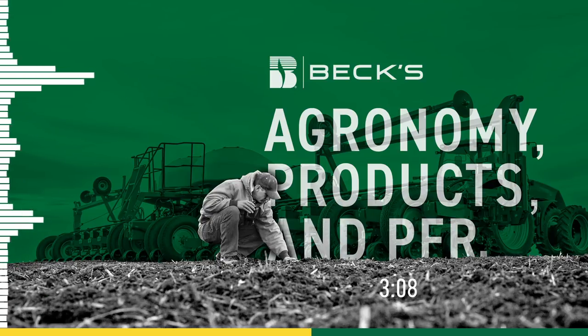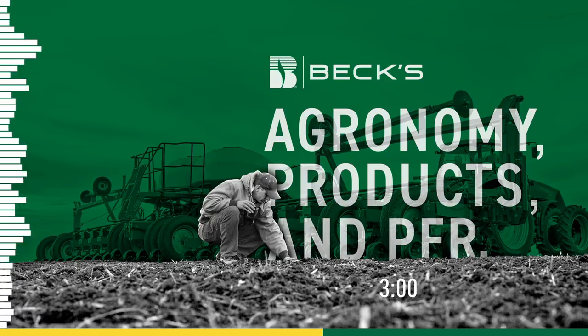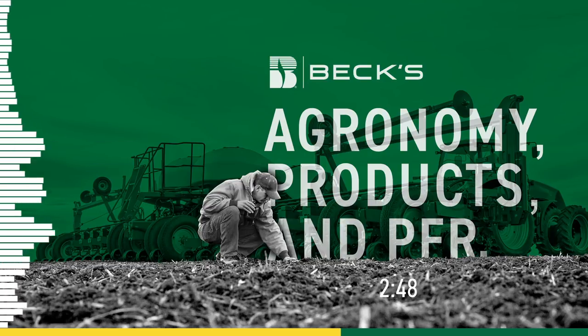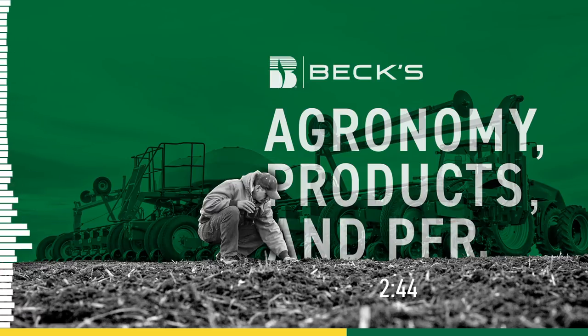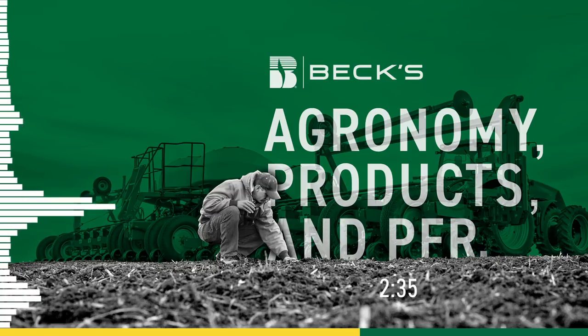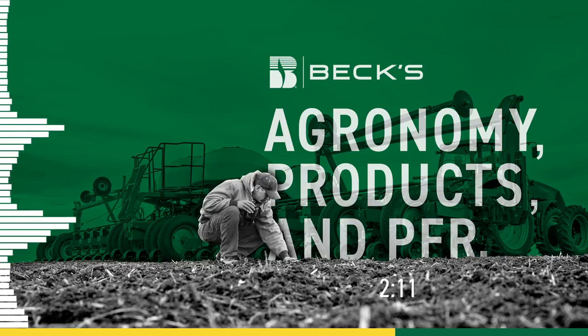Once I create that management zone in software — with someone's help — how do I execute it in the field? Is it simply going to my monitor and plugging it in? It really is that simple. The majority of our monitors today take a USB stick or a flash card. We plug that card in, and as we're loading the field and putting in our farm and field name to get ready to plant — inputting our hybrid information to track hybrids — most every monitor has a place for an Rx. We select the Rx, grab the file we've created, and once everything's set up, you just hit that file, load it, and it's automatic control. It takes over that planter, so as you move through the different zones — whether it's hydraulic drive or electric drive — the planter changes those rates automatically as it's going through the field.